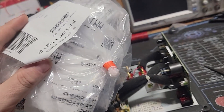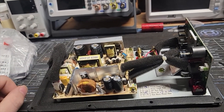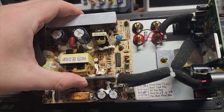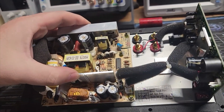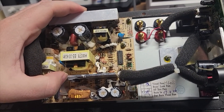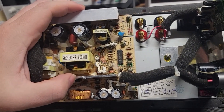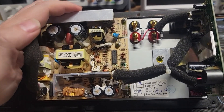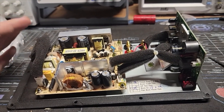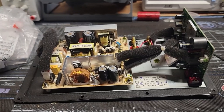Parts have been received, so I'm now going to take time to get all of these installed. I am slightly concerned about our negative nine and positive nine voltage rail — with one of them being closer to 15V, that could be an issue outside of the capacitors. But I'll know more once I've replaced the capacitors and retested those voltages. I don't want to bore you with replacing a lot of capacitors, so I'm going to get all the new caps soldered in and then we'll come back and do another inspection.